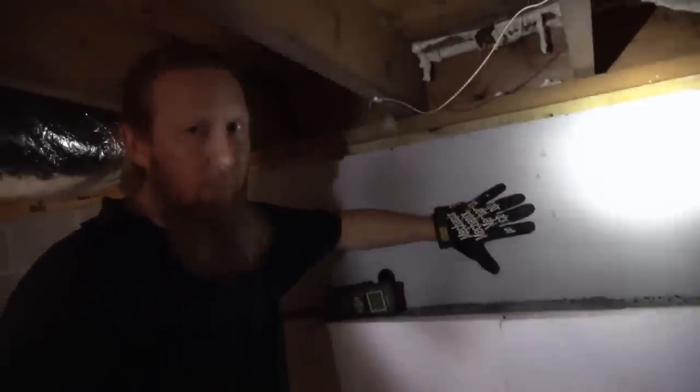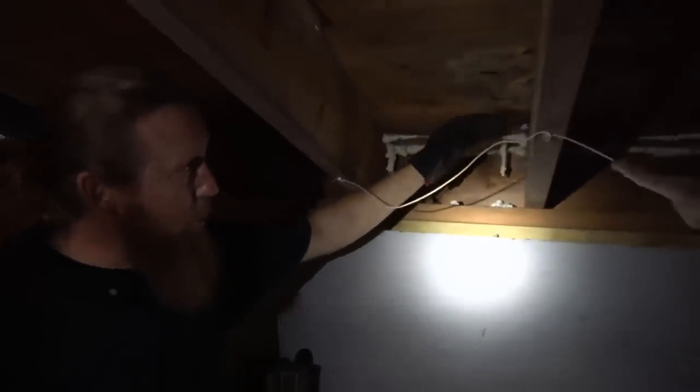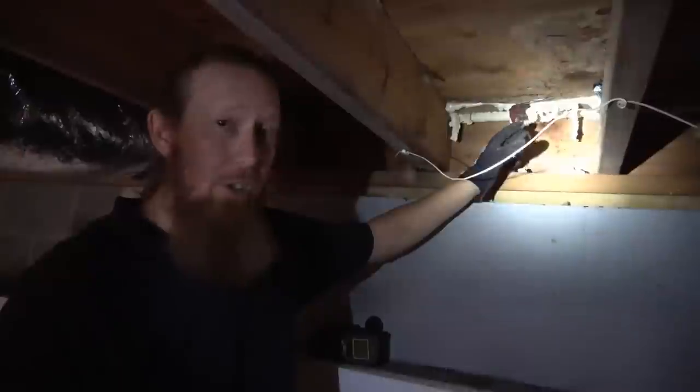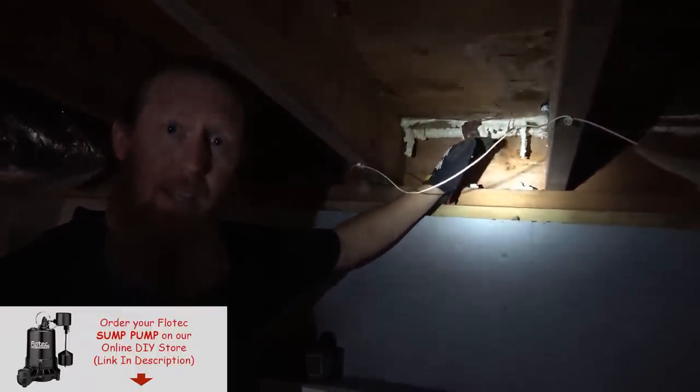If you're thinking about waterproofing your basement or crawlspace using paint, it typically fails — you've got to do a lot of prep work and install it right. And even if it had worked, it's still not high enough. We've got moisture damage up in the subfloor here. This could also be a flashing issue from a deck or something that needs to be addressed — we'll take a look at that to make sure we don't have more moisture coming through.